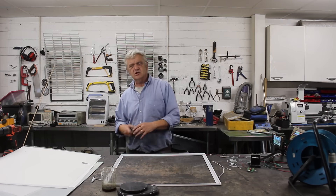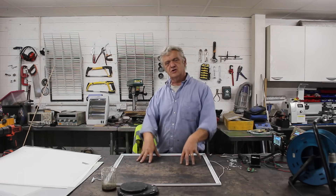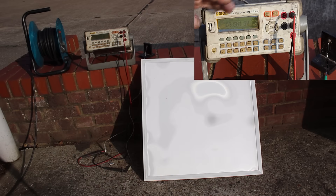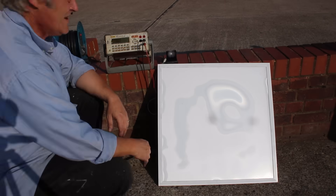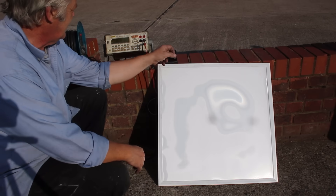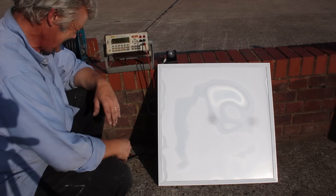So we've got here the potential of a homemade solar panel from an old light fitting. We just want to put the stuff back so the light hits the light guide and shines into the LEDs. Set up, it's actually producing about 3.7 volts. I'll give you a close-up of the meter - there's a little fan going there, and it is producing 49 milliamps. So about 3.6 to 3.7 volts and 50 milliamps.